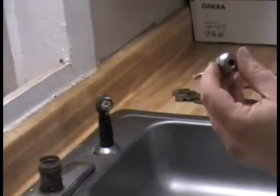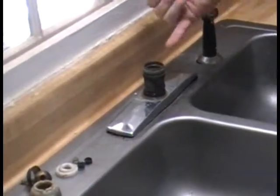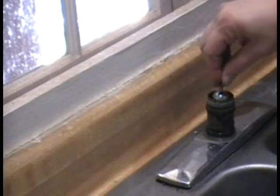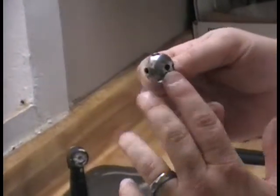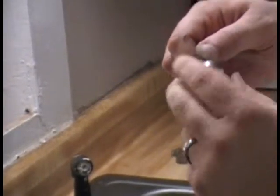Next is the ball assembly. This goes in very easily because there's a slot on only one side of the ball, and there's a little pin on the inside. The slot goes with the pin with the large hole to the front — the only way it can go. That keeps the ball in place. Those holes allow hot and cold water to come through on each side; as you rotate back and forth, it closes off or opens one hole for more hot or cold. The big hole is for the water coming out toward the spout.